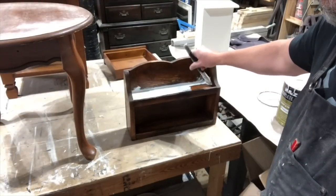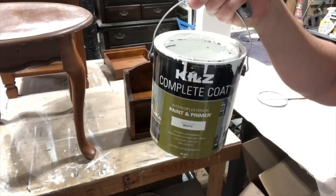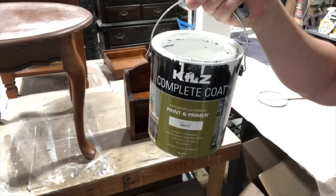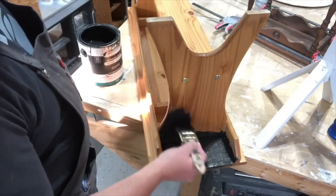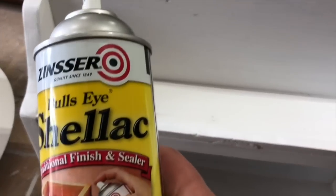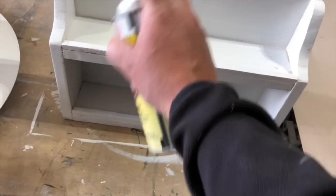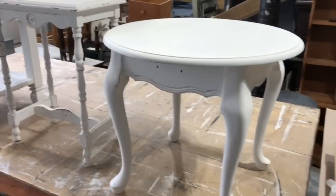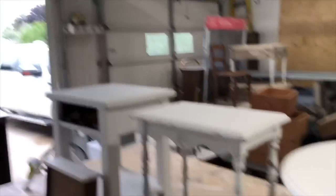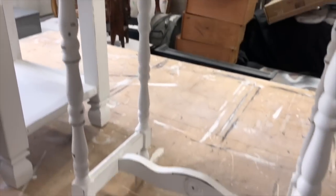Kind of like my small items, these medium-sized items all needed something a little different. Some of them are dark enough that they can just get the flat white Kilz paint and primer for their first coat, or like this bench that needed to be undercoated with black because it's a lighter paint. Sometimes on these more older vintage pieces, the stain, shellac, or polyurethane will yellow through the white paint. So we actually use a shellac, which is a clear coat, and that stops it from bleeding through the next coat of white paint. Our final process is that they all got painted white and distressed. If you're new to my channel, I can link some other videos where we show how we paint and distress the pieces.